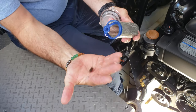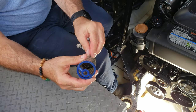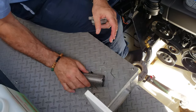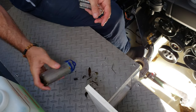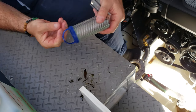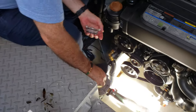For example, we've got a shell or some sort in here, and that actually could clog up your air conditioning system. So you periodically want to clean this out. This is just a prime example of what's inside these basket strainers. It's just typical regular maintenance. Debris will basically decrease the water flow through either your air conditioning systems or your generator, so you want to make sure they're nice and clean.